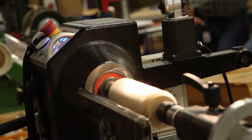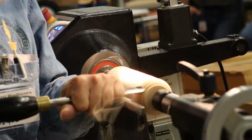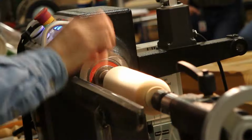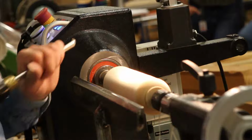The way that you want to practice is by saying, here's a stroke that I'm trying to learn. I'm trying to learn how to go from the top in a kind of spherical shape. Well, this is a quarter round. I'm just making a quarter round, starting from the top, and when you get to a depth that's approximately half of the depth that you started with, that's when you stop. You don't want to go deeper than that. As a rule of thumb, very easy to remember, your small diameter should be about half of your big diameter. It's a good rule of thumb in all spindle turning design, although there are millions of exceptions.